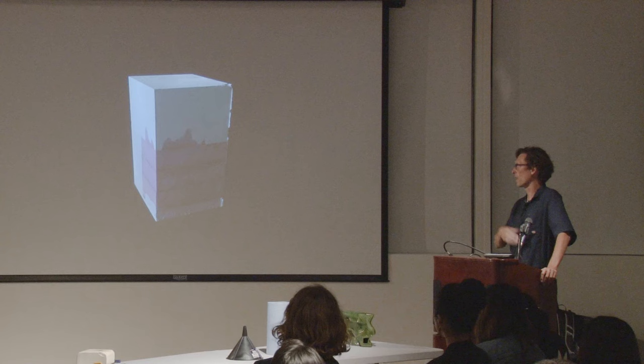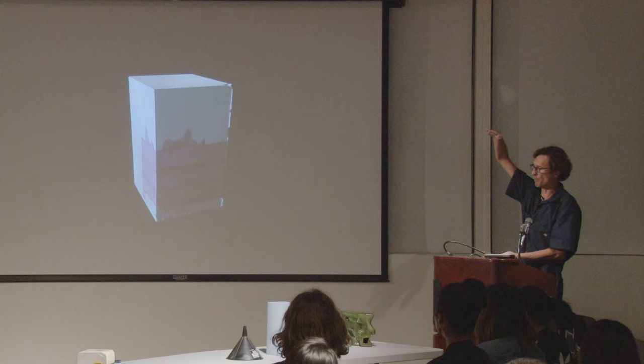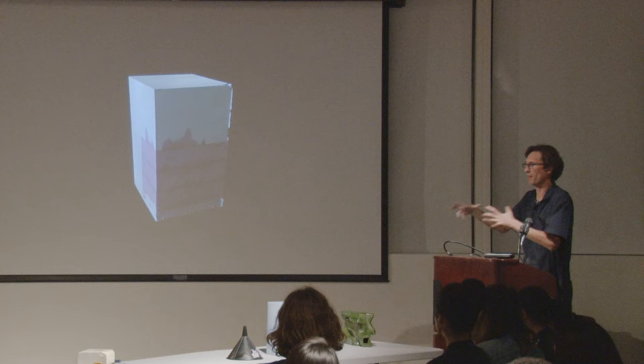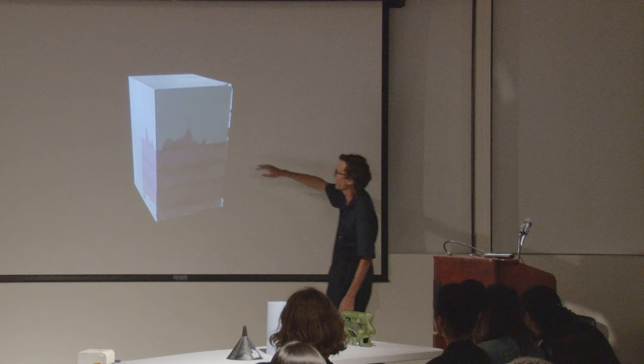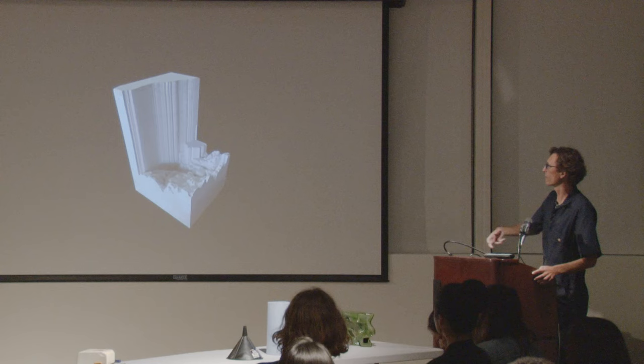There are also all of these steps, going back to Max's first question of the day, how do you produce these plaster molds? The ceramic pieces were mostly about this big, sometimes as big as this big. The molds had to be larger than that, right? So the molds would get to be quite large. They weren't something that I could just fabricate on the digital mill because you simply can't fit that much material into the digital mill. So I had to mill pieces of foam and then stack them, which you see here. So that's foam that's been laminated, that was milled, and then the plaster was cast into that. But the molds that it produced were actually amazing objects unto themselves.